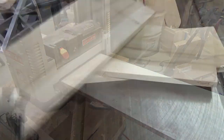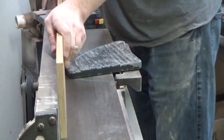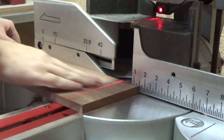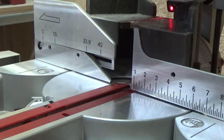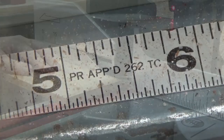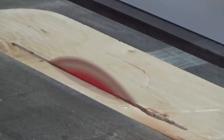And for this purpose that was just fine. But once they were all at the desired thickness, I was able to take them over to the joiner and flatten one of the edges. With one of the edges flat, I can cut them easily on the table saw. Here what I'm doing is feeling for the snipe on the boards and trimming that off on the miter saw, so that the snipe wouldn't show up in the finished product.